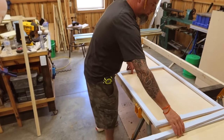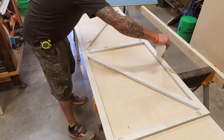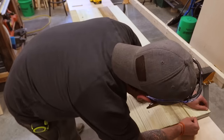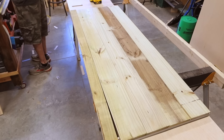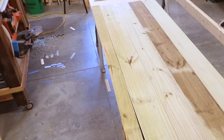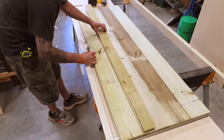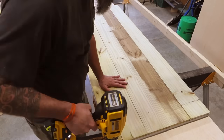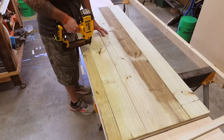Now let's go ahead and finish these doors. With the painted side down we'll put our trim into place, then put our shiplap boards on top — glue everything up real nice. The shiplap boards will actually hold our decorative pieces into place. After a couple of choice words, get back to work gapping everything out. If you have any little gap on the last board you can easily just push that back into place before nailing. I'm just marking out my decorative pieces to make sure I get some extra nails and screws into those so they don't fall off.